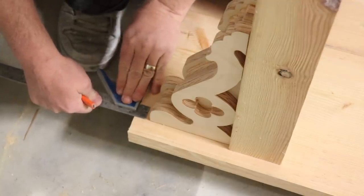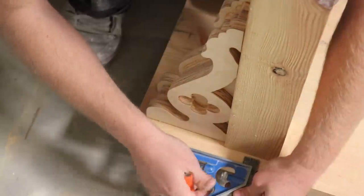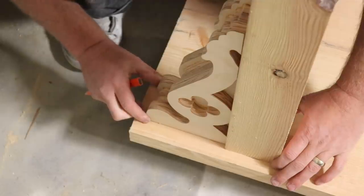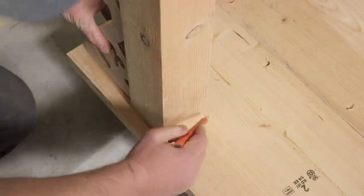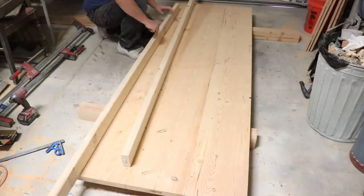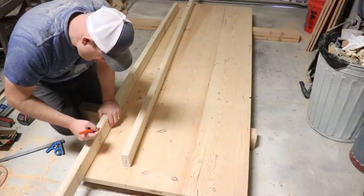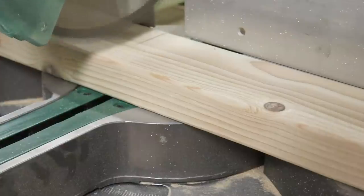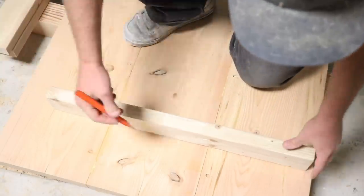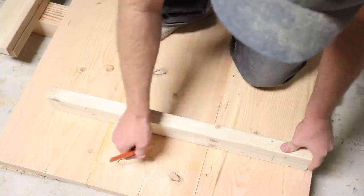Looking at the table and how it's set out, I'm going to take my combination square — the edge of this corbel and the edge of the leg is going to sit 3 quarters of an inch away from this end. I'm going to line everything up there nice and neat. Once the leg's in place, I'm going to leave a little mark right here so I know right where to put it back. I've got a couple of 2x4s and I'm going to line them up right on the mark I made where the edge of the table leg goes — that's where I'm going to cut them. The 2x4s I'm using are 104 inches long to start. I did that on purpose so I only have to use two 2x4s to make the whole skirt. This scrap piece cut off the end is going to work as the side brace, and I'll only have about 3 inches of waste left over on the whole board.